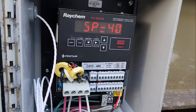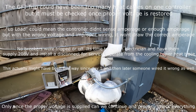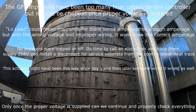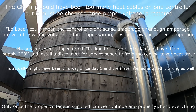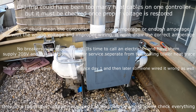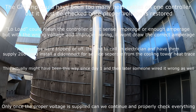Still pulling 2.1 amps. Two of the four heaters are wired improperly and we have the wrong voltage, but at least they've got something working for now. There's no reason to troubleshoot further — we already checked both controllers and we can't do anything more without the right power and correct wiring. We're going to wrap this one up. If anyone found this video interesting or helpful, please drop a like, comment, and subscribe. I'll catch you all next time.